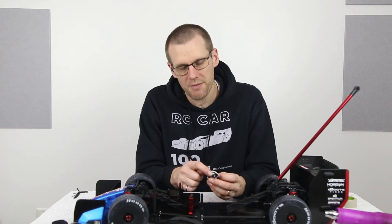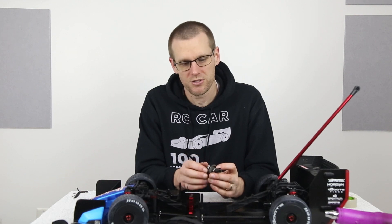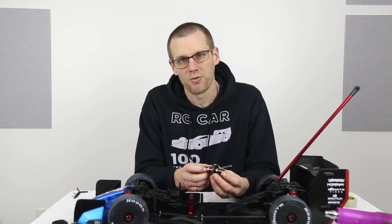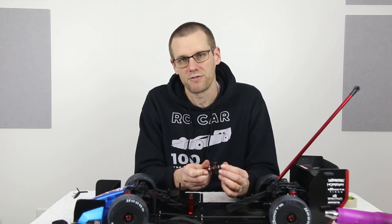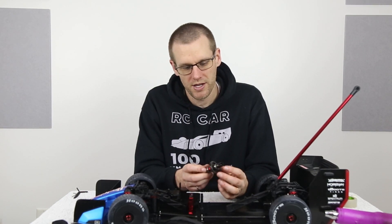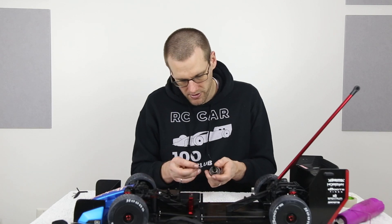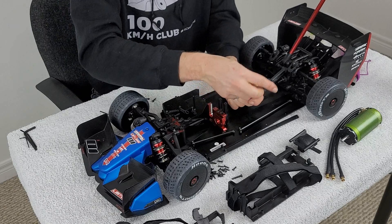The next thing we're going to do is heat up this section here. I would highly recommend applying a bunch of heat to these screws in order to get them off. The heat is going to break down the thread locking compound that's more than likely on there and allow quicker access to breaking them free. Otherwise you could damage the screw or your Allen set, and you don't want to do either. We hit it with about 20 seconds of heat — that should be more than enough. And yeah, it's like butter coming apart right now.